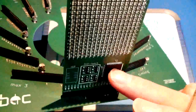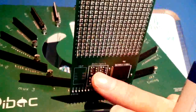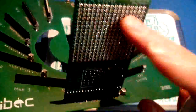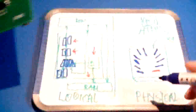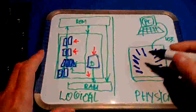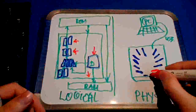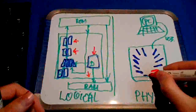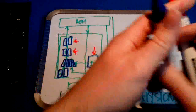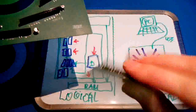This is also subject of another video, so we'll not do this in detail. But this module has two purposes. One is it implements the DIO latch, and most of the module real estate is used for the display, right? Display controller and the matrix display. So DIO basically corresponds to, is implemented using one plug-in module, or actually half of a plug-in module sitting right there. Yeah? The other half of the module is used for the display. So this module has double purpose, yeah. So blue is the logic purpose and red is the display purpose. So that's that, right?